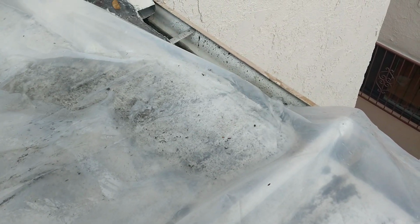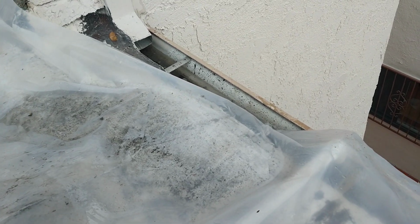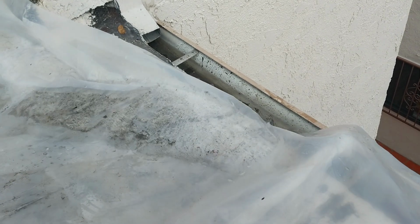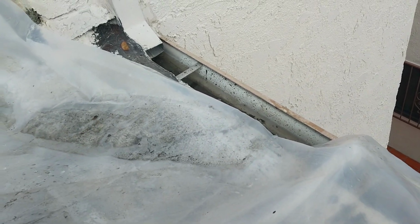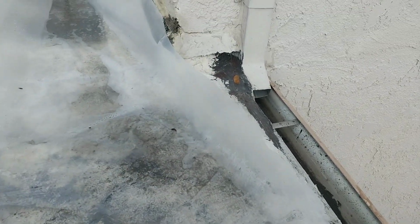Now what I'm going to do is this, because the water is pooling, is take this plastic and just kind of stretch it out so it doesn't stay here, because the water has to go someplace, and just move it a little bit so that the water can start to flow off and you get a little relief. So that's how much water is just pooling over the top of this plastic. So if you're getting any leaks or drips in the actual house, it's not because of the rain, it's because of the pooling. So that is something that we'll have to look at.